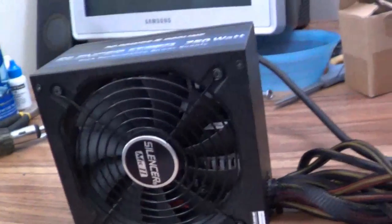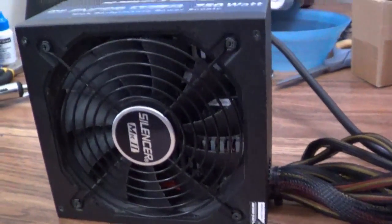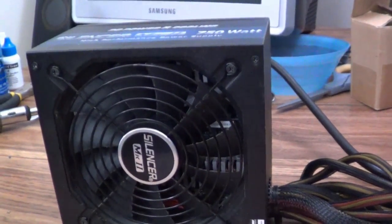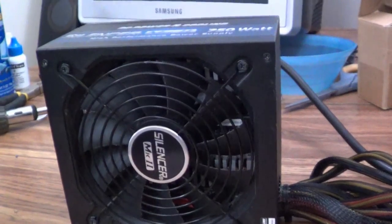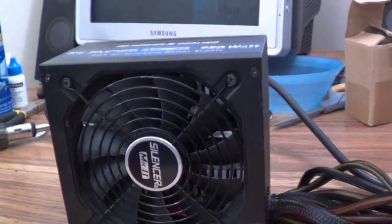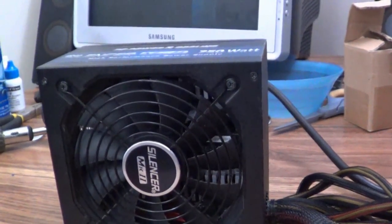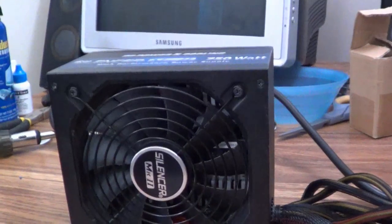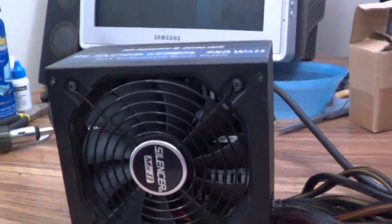There's an e-tailer out there that used to be a competitor to Newegg back in the day. I think they're still around. They're called Directron.com. They used to have an article about buying power supplies by the pound. Basically look for heavier power supplies in order to get bigger components, thicker wire and stuff like that, unless you get some jerk manufacturer that just puts a big steel plate in the bottom to weigh it down.